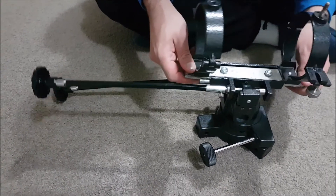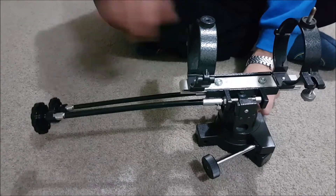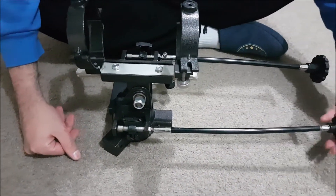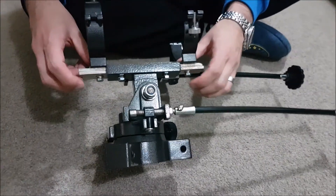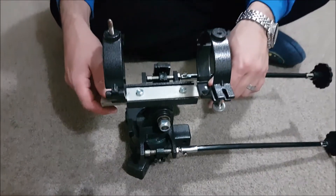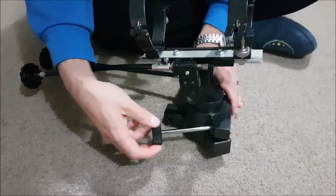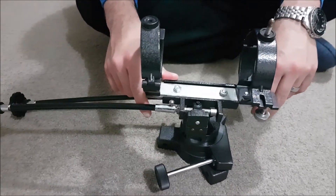As you can see the mount has been refurbished — I can now easily move the altitude and azimuth as well as the slow-motion controllers for both altitude and azimuth, so that's all been repaired and refurbished. I've also noted that the previous owners broke off the plate, so they introduced a secondary plate, which is fine — it still serves the same purpose, so I'm not going to make any modifications to it. Also noted, the tightening knob for the azimuth axis has also been repaired. From here I'm going to mount it back onto the tripod and then move onto the optical tube assembly.